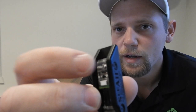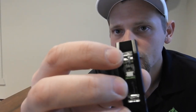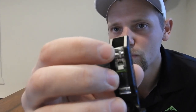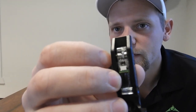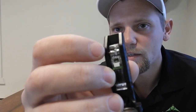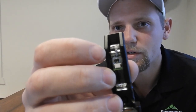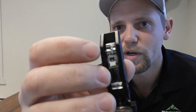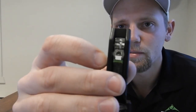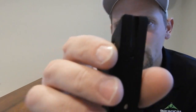The block itself is threaded in the wall, and there is a nut inside. So you're screwing into the nut and into the wall at the same time, and it moves the polycarbonate guts over the distance of the pitch difference — much slower than any fine-threaded screw alone. The same system applies to the elevation adjustment, with a 4-40 nut and a threaded base for fine adjustment.